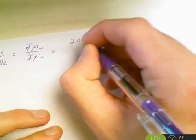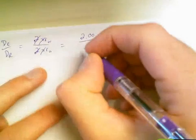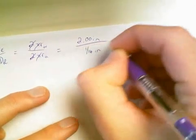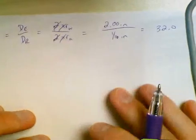The wheel radius, if we look at our design, is going to be two inches — I measure from here to here, so it's 2.00 inches. The two pi's cancel, so the radius of the wheel is 2.00 inches and the radius of the axle is half the diameter, so it's one-sixteenth of an inch. That value comes out to be 32 for the IMA of the first mechanism.